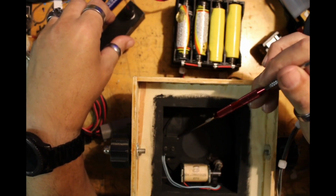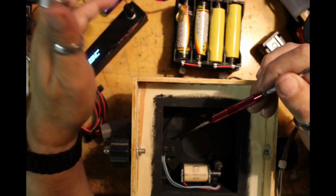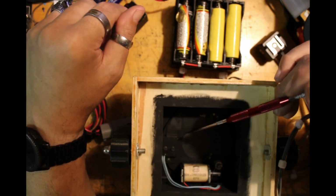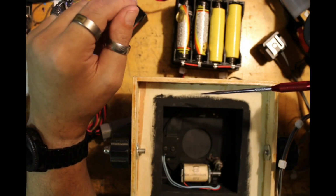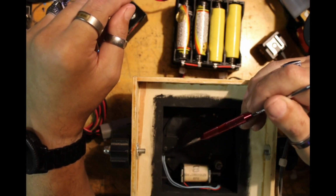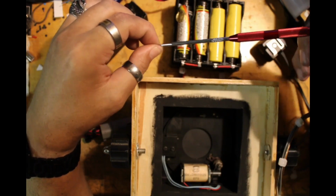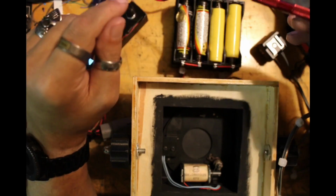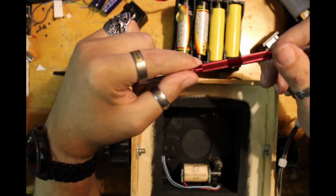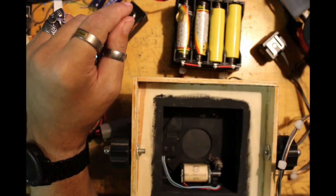And because it is a contact switch, this is actually rated, because I did pull it off to make sure it was clean and everything was connected properly, this one's actually rated to 250 volts. So even like my vintage studio strobes, which have a 70 volt trigger voltage, no problem with this. Some of your vintage flash units, electronic flashes, are 150, 200 volts. Not many go over that 200 volt point, but just something to be aware of. That's why some of those flashes cannot be used with modern cameras, because modern cameras use a simple MOSFET and would be burned out by that.